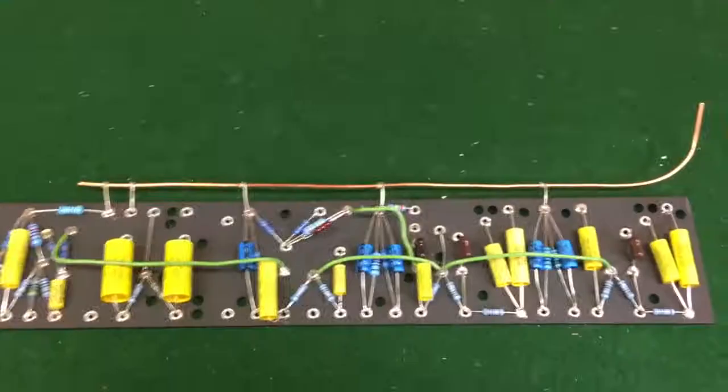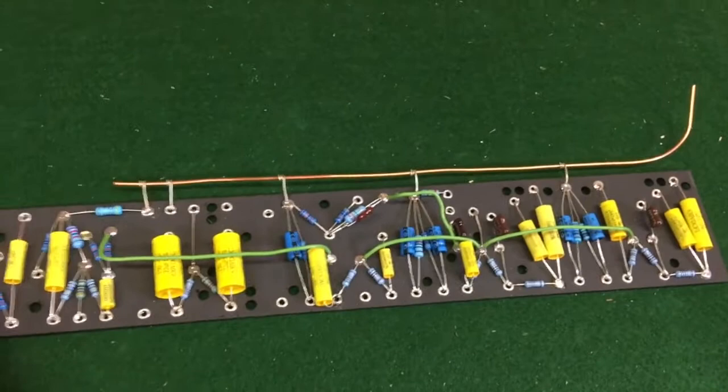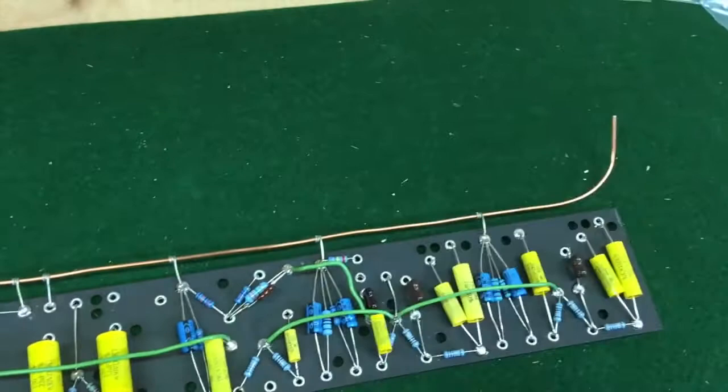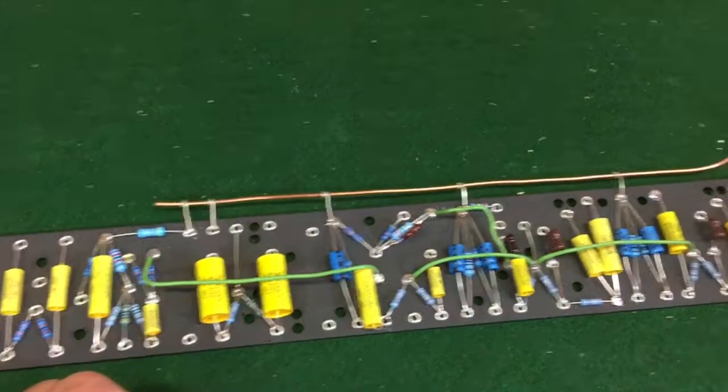The next thing I did is install a ground bus. I decided to use this piece of heavy gauge copper wire — I believe it's 12 gauge — instead of the plate, because I want control of where the currents are flowing inside that particular ground. This end here will be terminated at the input jack, and there'll be another ground bus run from the doghouse over to the power supply. This hasn't been soldered yet, but eventually all the grounds — the low signal grounds anyway — will be soldered to that.